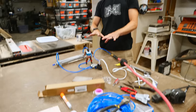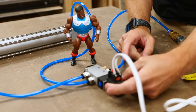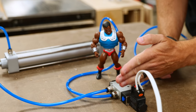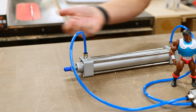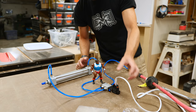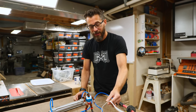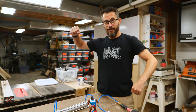I think I have it working. It's very simple — the solenoid is basically a relay, so power turns it on and off, and all that does is divert air from one hose to the other depending on whether it's on or off. Those two hoses go to the two ends of the piston. If one gets air it draws back, if the other gets air it pushes out. Really this is just about adding power or taking away power from the solenoid, so we need to add a simple 110 switch to this line.